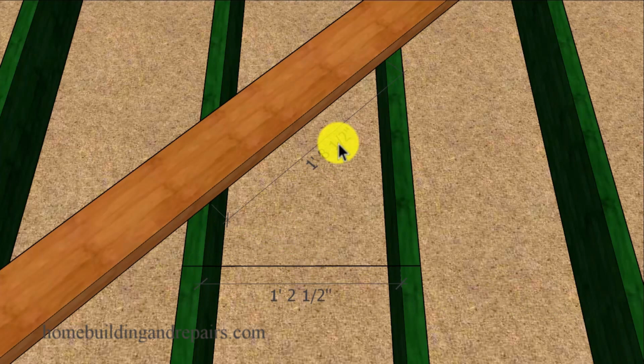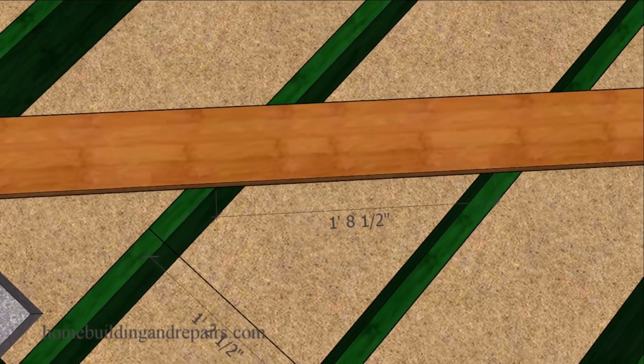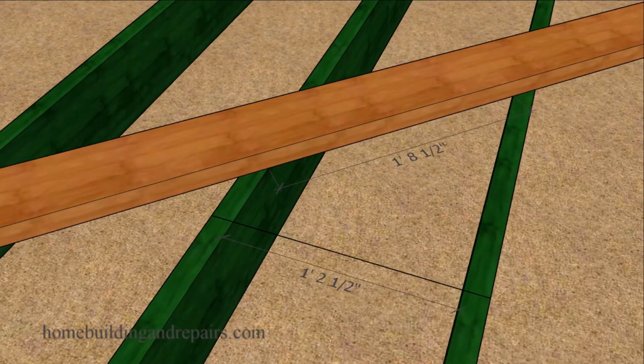However, that's not going to be the case over here. We're going to have a 6-inch larger bay, suggesting that we could run into a problem if the deck manufacturer is requiring a 16-inch on-center spacing for perpendicular decking and doesn't provide you with installation instructions or on-center spacing for decking that is going to be running at an angle. And if we make the angle larger, for example, a 60-degree angle, then we might be dealing with an even larger measurement or gap between the joist.